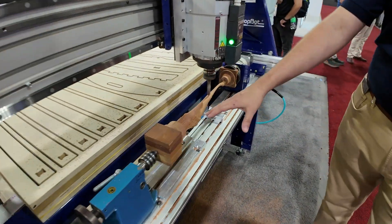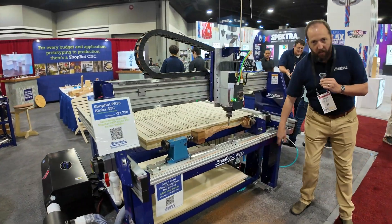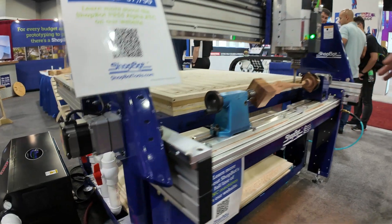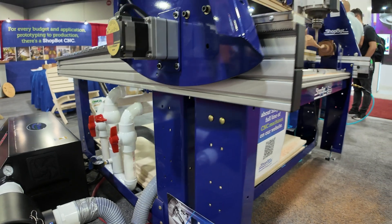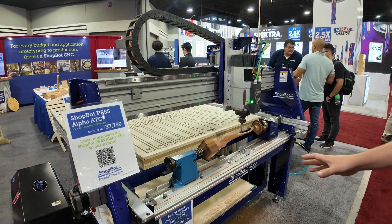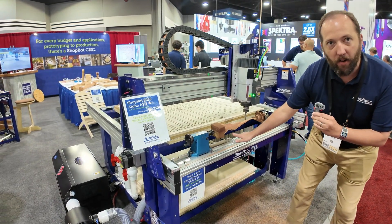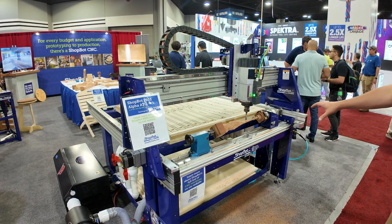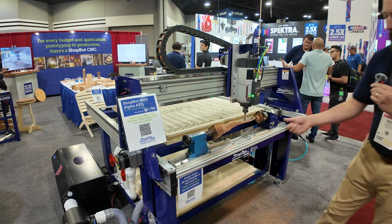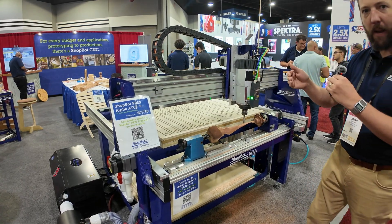Here we're just cutting a decorative table leg, doing a roughing pass using a large ball-nose bit. The components mounting the 4th axis are just our regular table legs and cross supports, which means you can add a 4th axis to your machine at any time without having to buy extra parts. You simply lower the surface of the cross support so that you can get your cutting area even with the table, then mount your indexer extrusion to the cross support — making it quick to install and easy to adjust the height for turning larger or smaller diameter parts.